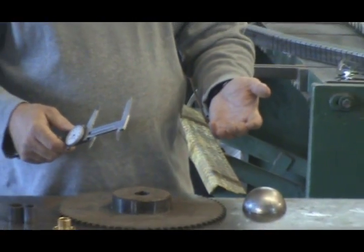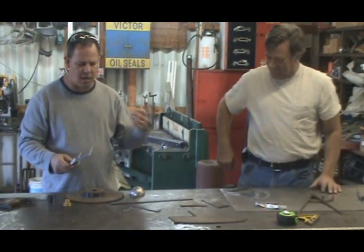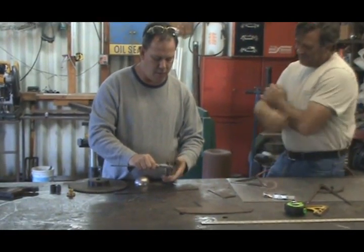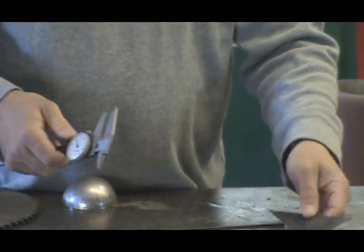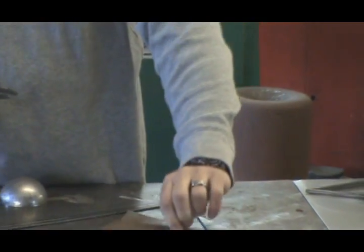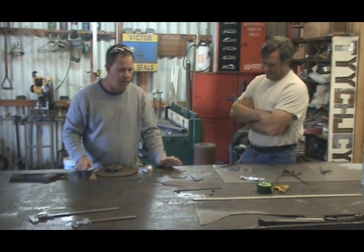What happens a lot commonly in the shop is we get scrap just laying around all the time. We've got this piece — what size is it? I thought I used 18 gauge, I thought I used eighth inch. It's bent, it's manipulated. This is where it's really handy to have calipers. All you have to do is bring them over and snap it on there — that's a hundred and twenty thousandths. That's an eighth inch piece. But this other piece over here — sure enough, it's gauge and it's not a hundred and twenty thousandths. So if you tried to put all these pieces together, like the old Sesame Street, two will go in, one won't. It's really a handy tool to have.